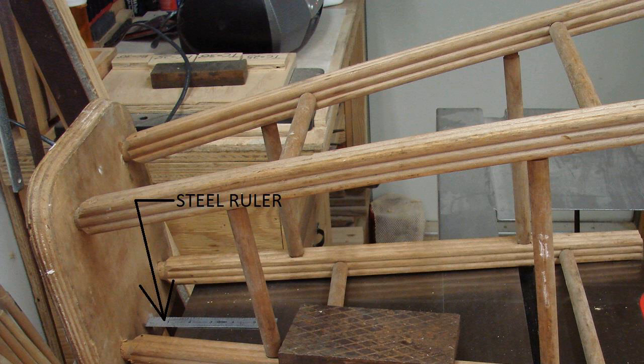Step 6. Cut the legs using a saw. Types of saws suitable for this type of cut are a circular saw, jigsaw, and hand saw. If you don't have much experience using power tools, you might want to use a hand saw. Cut the stool legs one at a time following the marks made in step 4.